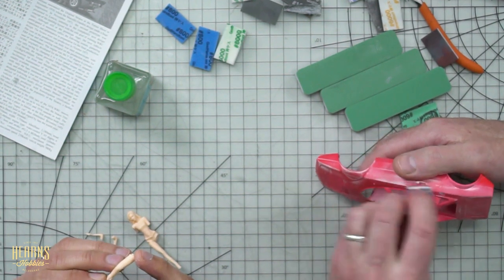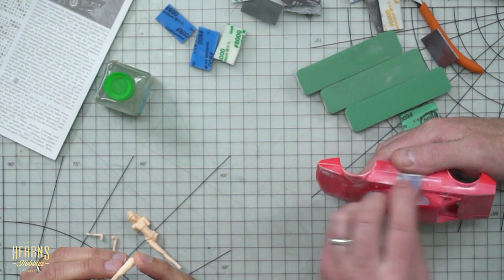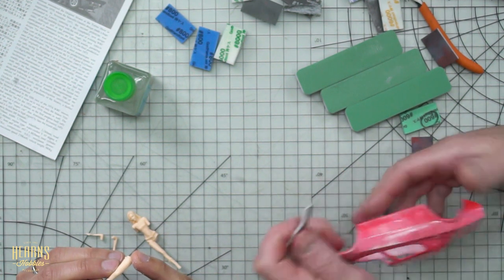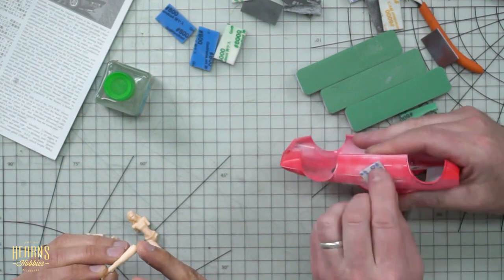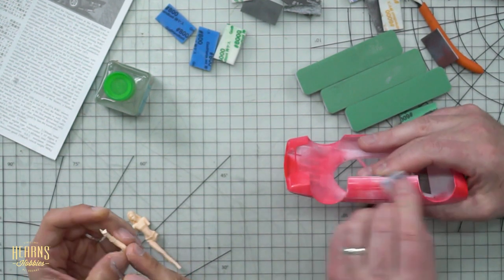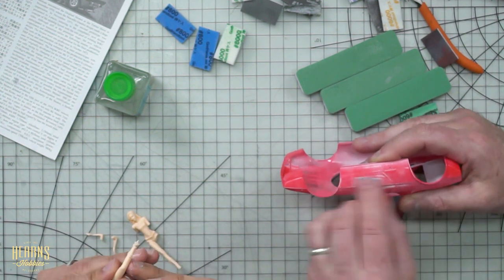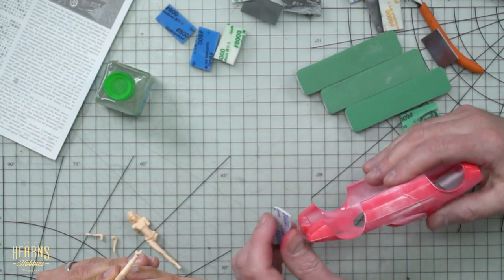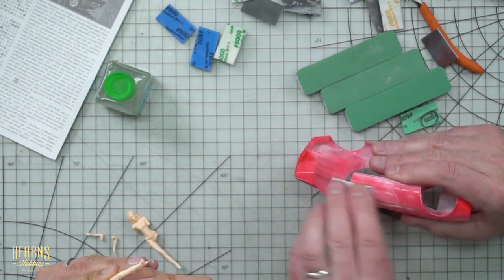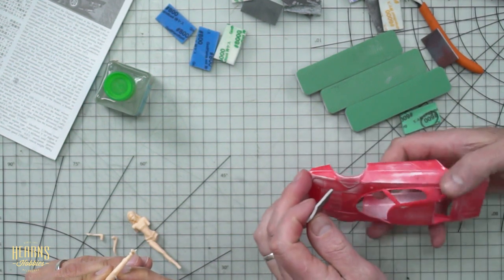But if you're doing this at home, a tack cloth. Is that what you're saying? Yeah. If I was doing this at home and I had the time, then I would be washing, because the water will get rid of all the fine dust. Do you think it gives you a better finish sanding? Wet sanding? Yeah. It will later, for sure. And particularly if you're sanding for polishing, you really need to wet sand, otherwise you'll never get rid of the micro scratches.